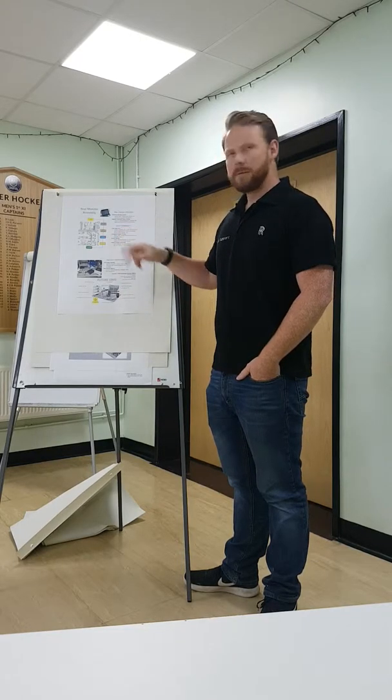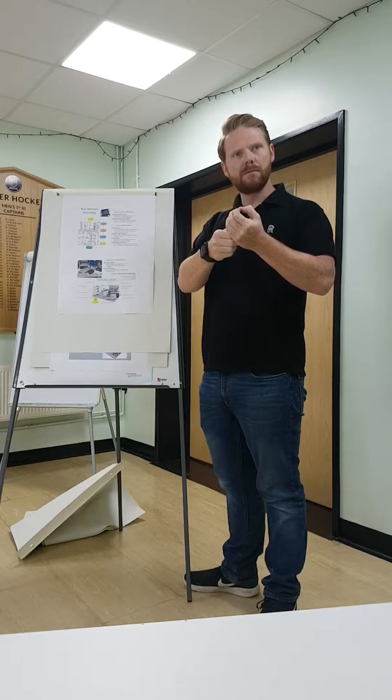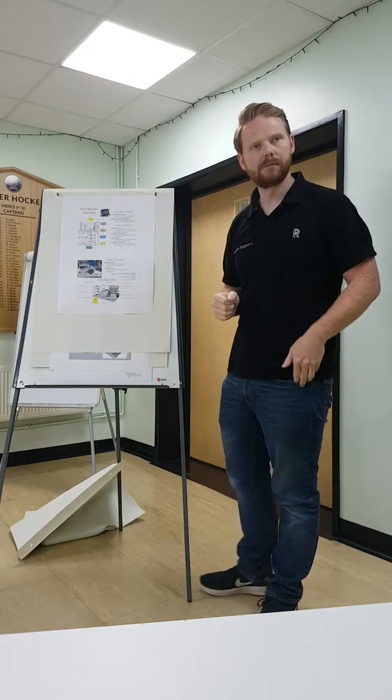Regarding the digitally controlled torque tool: there are various fixings on the end, and if you select a tool with a red band around it, as that clicks into the gun, the gun recognises what the fixing is and sets the correct torque — for example, 1.2 newton metres — automatically. The torque will be changed digitally so that when they tighten that fixing, it maxes out at the correct newton metre setting. In this particular situation, there's no long-term activity looking at display screens.